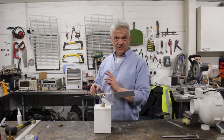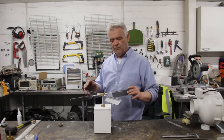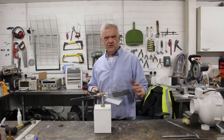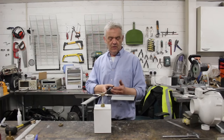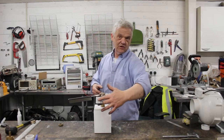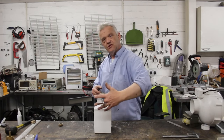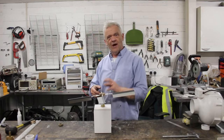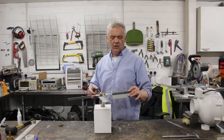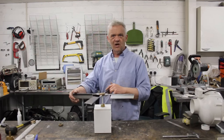The blades are free to swivel on each other — they're at 90 degrees and offset against each other, fixed on the same axle. As it turns and gets hit by the wind, it presents that surface and gets pushed. As it's doing that, this one is levered up to present the least amount of surface, so we don't have much drag here and we get a bit of push there. As that one comes around the same thing happens, so we get it to rotate.